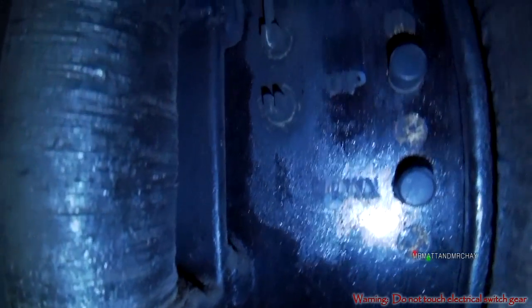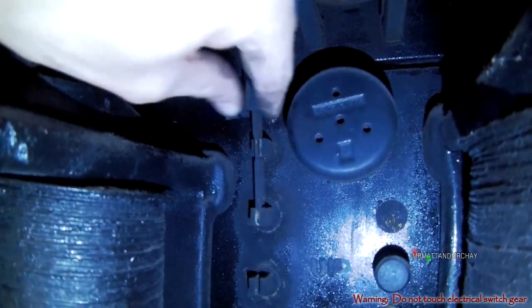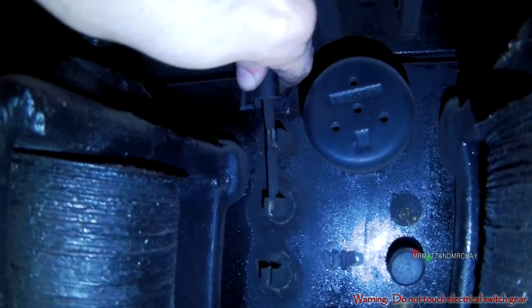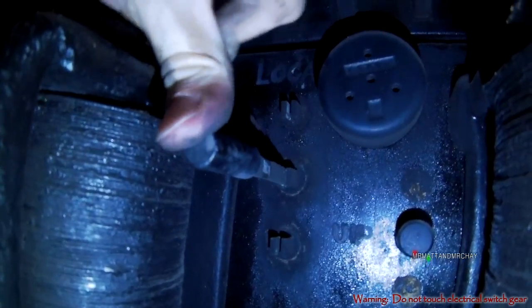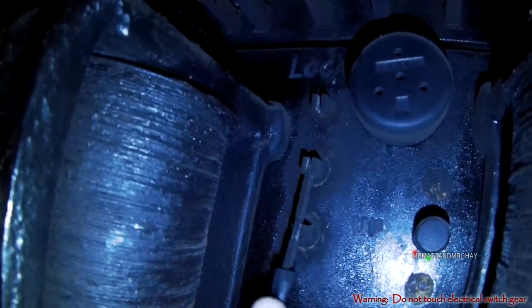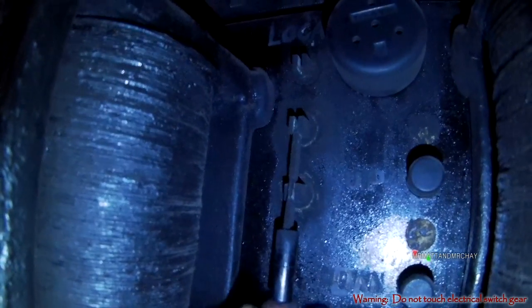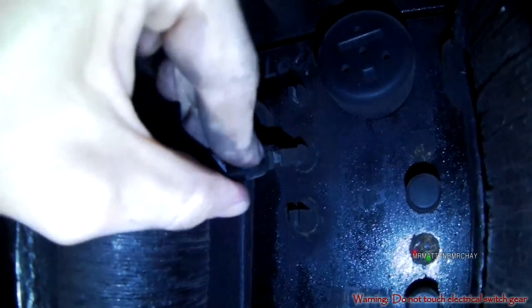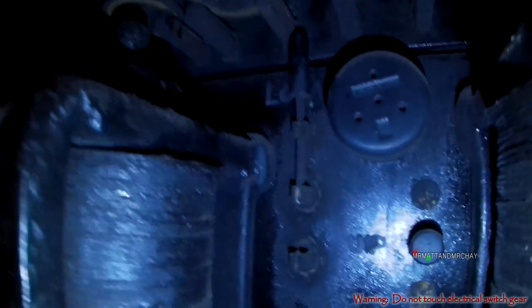Beside the up down test buttons is a knife switch. This is a switch in a very basic form. The knife switch is basically a piece of metal joining up contacts. Power connects from the middle to either the top or the bottom connector. When it's moved down, the top terminal is disconnected, which turns off all the call buttons so an engineer can work on the lift without interruption. With the knife switch pushed into its bottom terminal, this enables the up-down test buttons on the right. I suppose this is a very early inspection mode switch.